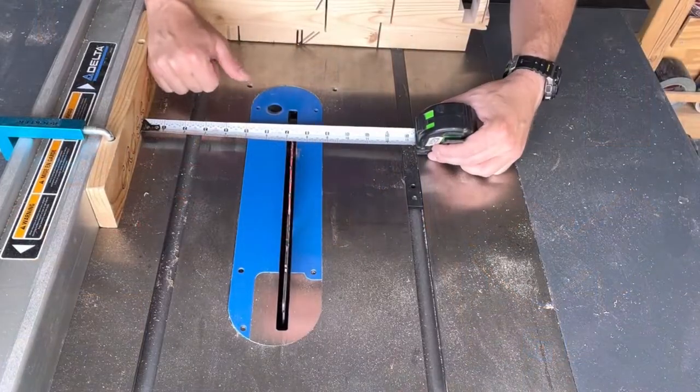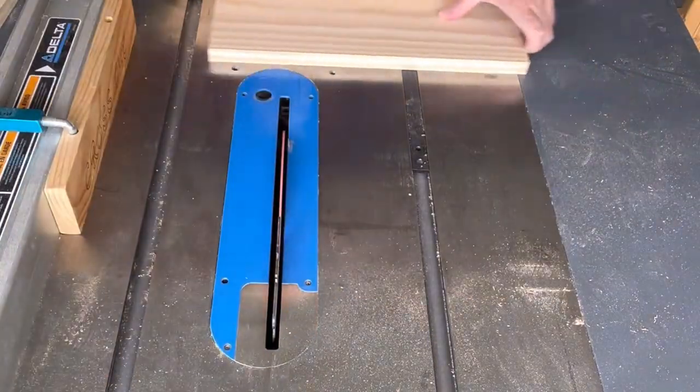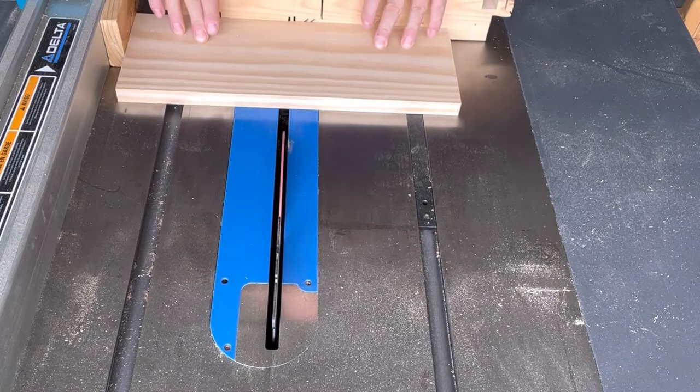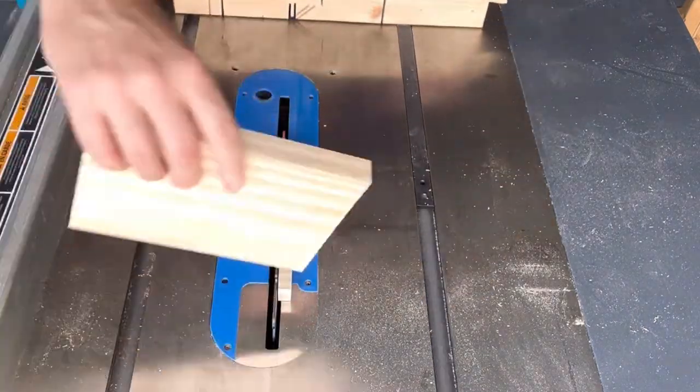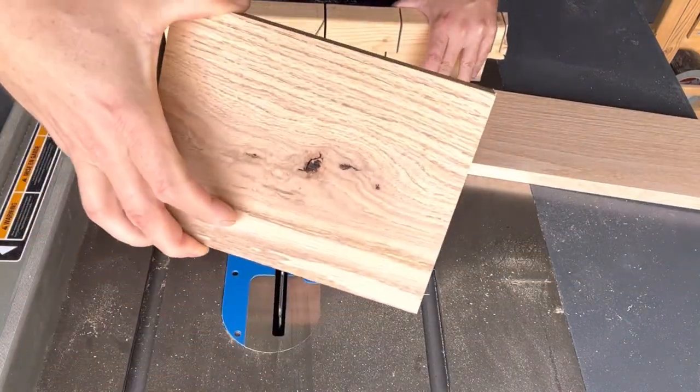For cutting the frame, this could vary depending on the block you have. For these blocks, I figured out seven and five-sixteenths works best, but you've got to be right on that — anything under and it becomes a really tight fit, so set your saw just a hair over. The base is eight and three-quarter inches long and the width ended up being five and a half. Some of the oak boards had cool knots, so I made sure those were visible and on top.